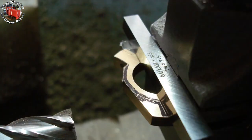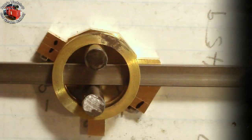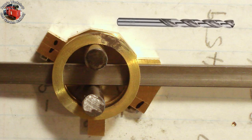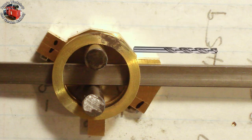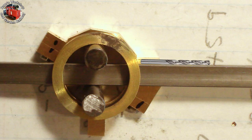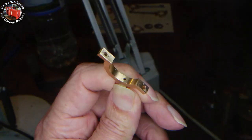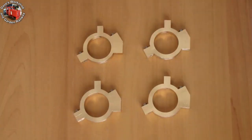Roughly milling around the profile but to the correct depth. Sighting along the tool steel to get the pad parallel with the cut. Checking to see where the centre line of the bore is in relation to the pad to mill the slot for the rod — the rollers are one quarter inch diameter and the strip is a quarter inch wide. Making sure the lines are parallel and then measuring the dimension with a drill shank. The finished slot: 0.260 wide centres. After the oil holes were drilled and the rod slots milled, the profiles were smoothed by filing — an enjoyable bit of bench work.